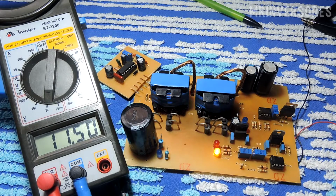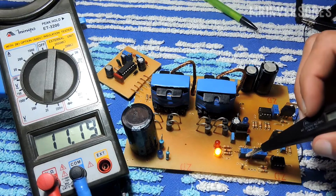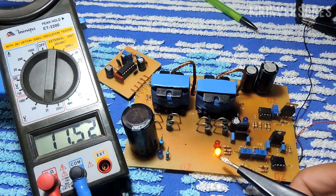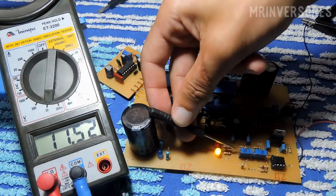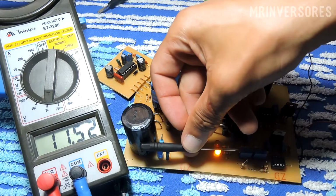So, going down here, look, at about 11.2 I want it to turn off the inverter. So here, guys, you can see that it was ill-adjusted, it started to cut when the voltage was more or less there. Let me raise the voltage again to confirm. It started to cut when the voltage was close to 11.6V or 11.5, and to adjust it to 11.2 it's simple, just turn the potentiometer here. I'll try to do it with one hand since I'm holding the lavalier microphone.